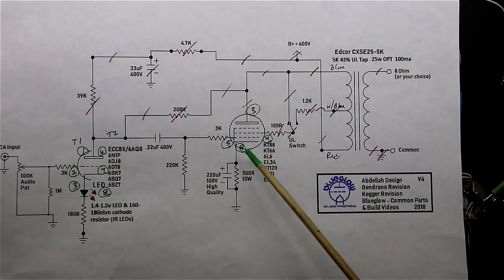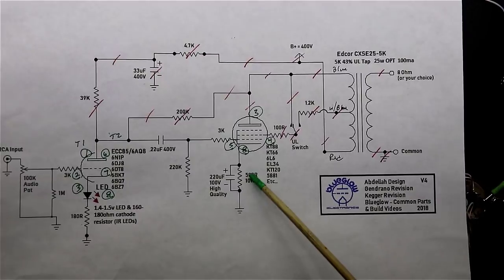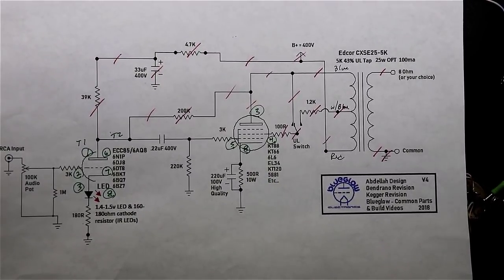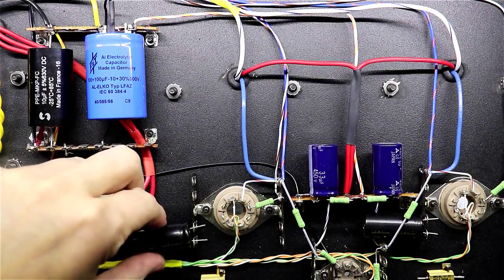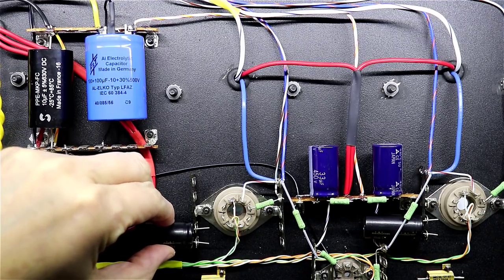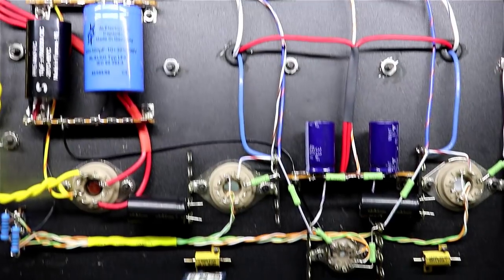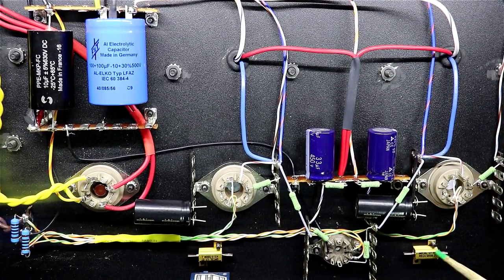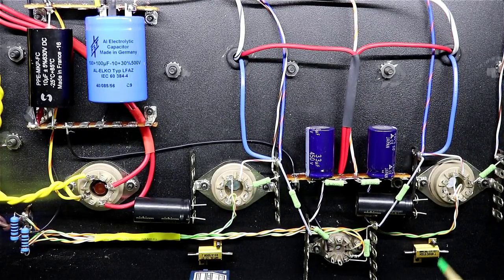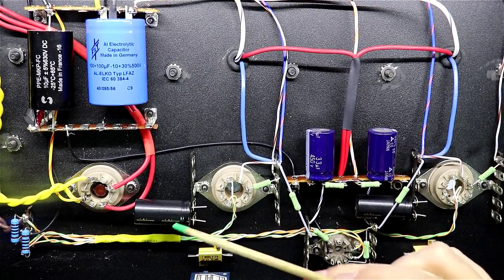So onward on part 7 here, we're going to dive in now to finishing wiring up the KT88 first, and I'm working on the 500 ohm 10 watt resistor here, and in parallel with that I've got to put this 220 microfarad 100 volt high quality cap. In this case I'm using a Nichicon Muse, and I'm going to take both of these Nichicon Muses and mount them into just these two little side lugs that are unused at this point, and you may be able to see them down here. These are my Arcol 500 ohm resistors, and I found a nice place somewhere centered between the tubes, which will be pin number 8 as the cathodes, and we're going to have to wire this in parallel with this, and we'll just do that via wires.